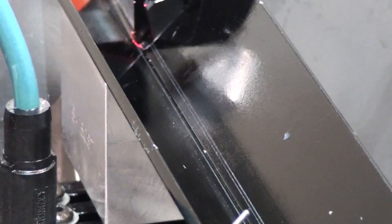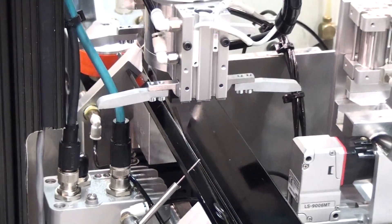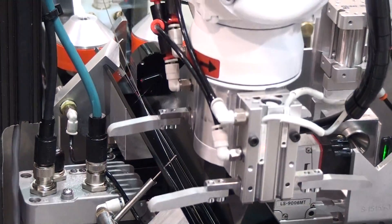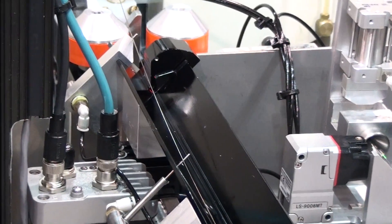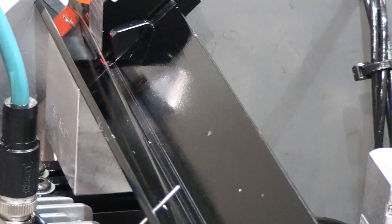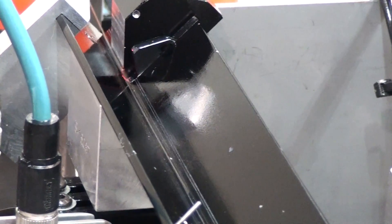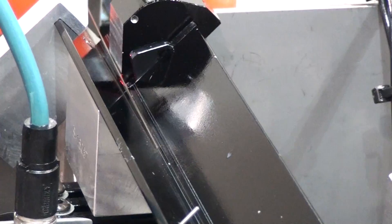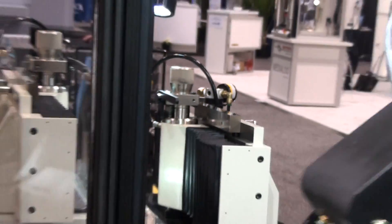With these newer spindles and machine bed and base, we decided that now is the time to eliminate all hydraulics for the machine. We also added stepper drive for programmable traverse rates and ball screws to our dressers as standard equipment. With this new platform, wheel dressers are offered as air sensing, automatic dressing, over the wheel CNC, as well as rotary diamond disc CNC platforms.